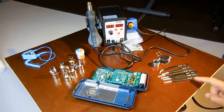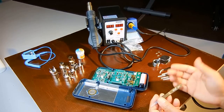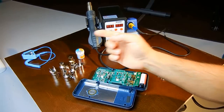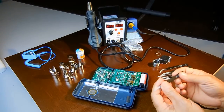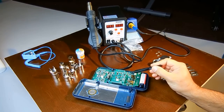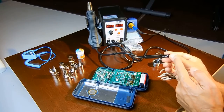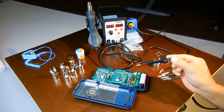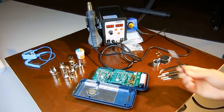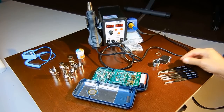I highly recommend you purchase a set of electrostatic tweezers. If your body picks up a static charge and you go to touch a component — especially if you're not wearing an electrostatic wristband — that charge will transfer through the tweezers to the tip and you will end up destroying a component. With this special coating, the static charge on your body cannot reach the tip to be discharged on the component. They come in a lot of different tip sizes. Curved is my favorite, and we'll be using that in this demonstration.